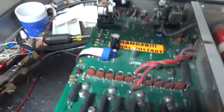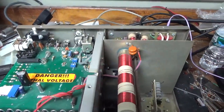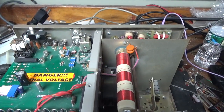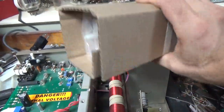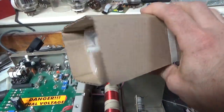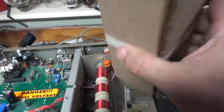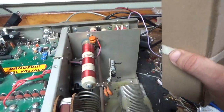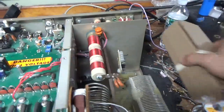I don't try to clean plates anymore, because a lot of times it doesn't rejuvenate them to the point where they have the same voltage breakdown as a stock one, so I always put a brand new one inside. I bought up the stock from Ameritron, and I'll have more made once I get close to running out. These are not for sale right now — eventually I'm going to start an Ameritron page on the Harbach site. Brand new.